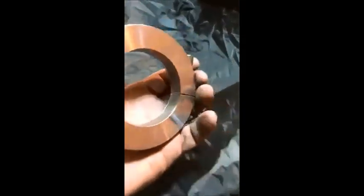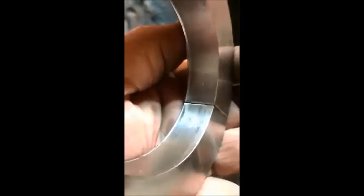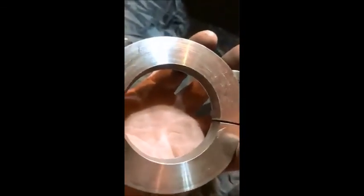Here's one tool I had to make — it's a split bearing grabber. It grabs the outside. In the middle section I accidentally slid on a bearing about ten thou too far, which caused my alignment rings to not fall into the slot. So I had to grab it, and you can see there's just a little tiny lip there that grabs the back of the bearing while also clamping on the outside. There would be a space as it's clamping, just from my saw blade width. A little quick tool I had to make.